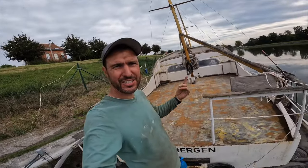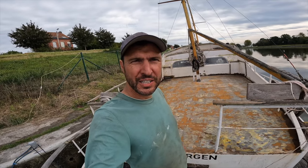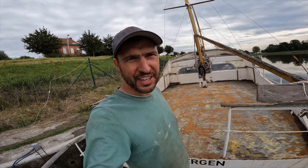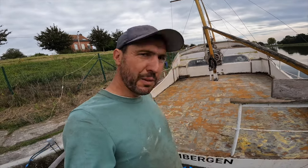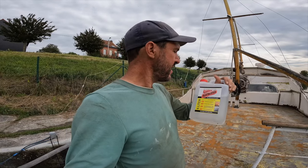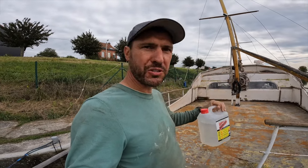So, this is what I'm left with. Very pleased with the result. The little bit of rust you see is called fly rust. I did that on purpose. I'll be using a product called Ranex Rust Buster. And I'll be spraying that on and leaving it on for about 12 to 24 hours, we'll see. So, thank you Project Brewpack for the tip. See how far this brings me.